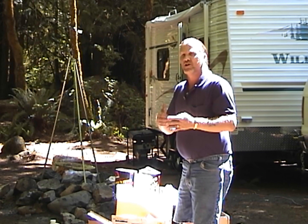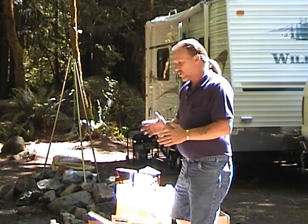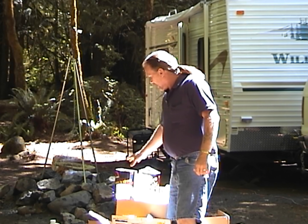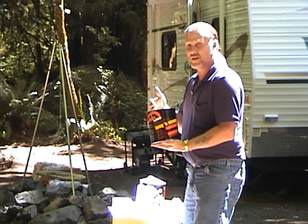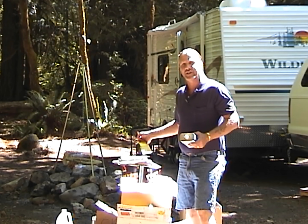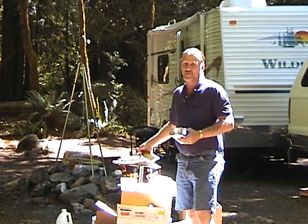We'll put the molding rubber on after we've sealed it. Usually I'm going to do it in three coats — the first coat's real thin, capturing the definition, then I'll back that with a good heavy coat and then one more heavy coat, and we should have it ready for the hard mold. I prefer the cementitious hard mold using fiber, as you've seen in my DVDs, but today I brought out long-strand fiberglass from the auto parts store with the catalyst. The reason I've chosen that here is to expedite the hard molding — if I use the cementitious way I'd have to wait 24 hours to demold, whereas with this fiberglass I'll be done in about 15 minutes after placing it. I'll put the fiberglass on the rubber once it's dry, then peel the hard mold and rubber mold off within about 15 minutes.